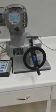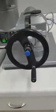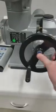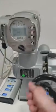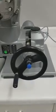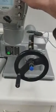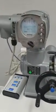The hand wheel itself is convenient because it just uses a push button mechanism. So if you have to climb up a ladder to access this actuator, you can maintain three points of contact. With your free hand, you can push in the declutch and then start spinning the hand wheel. Once you've done that, you're engaged and free to operate the hand wheel. And anytime you operate it electronically, it automatically clutches the motor back in and declutches the hand wheel, so you never have a hand wheel spinning at the same time as the motor — that would be a hazard.